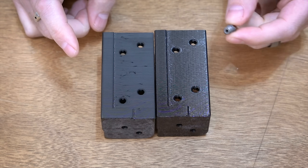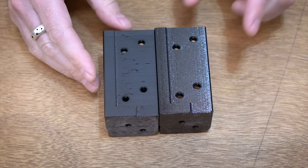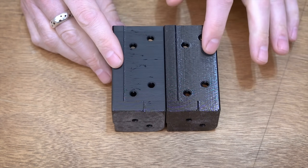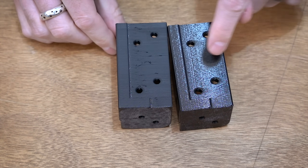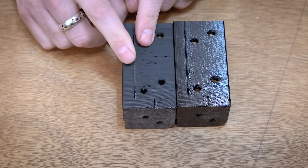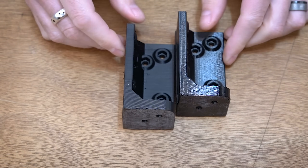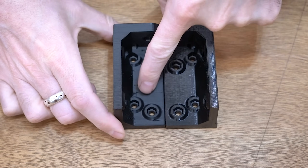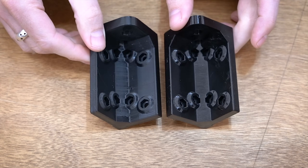Now let's compare it with one of the other parts. This is the same filament and same profile and same settings, but this one is very matte — you can see there's no real shine to it. That's because the temperature was way under what it should have been. The Nozzle X just insulates a little bit so it's not really able to transmit the same amount of temperature into the filament. I found this really fascinating — same filament but just not nearly as shiny. In the corners where it slowed down you can see a little bit of it, but generally speaking this ran at a much lower effective temperature. You also see a little bit of zits and blobs on this one that are just not anywhere on the Diamondback print.